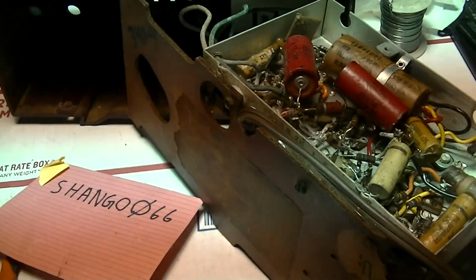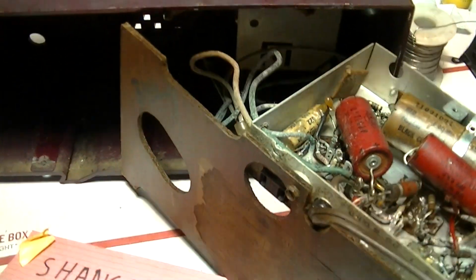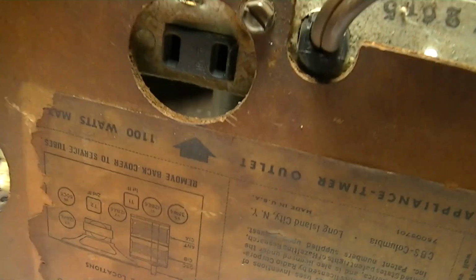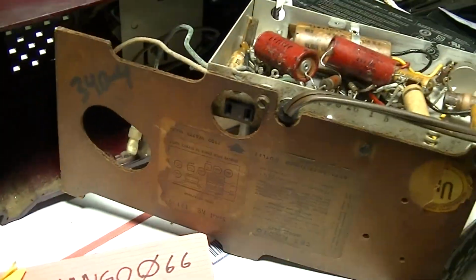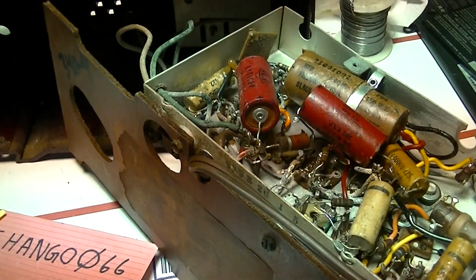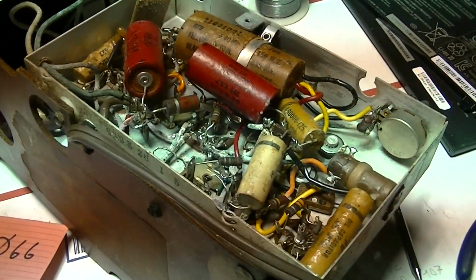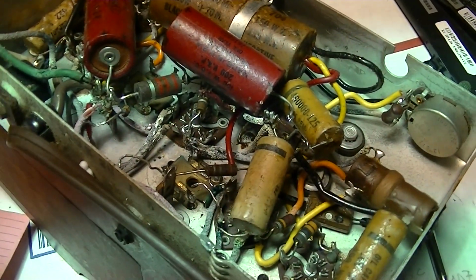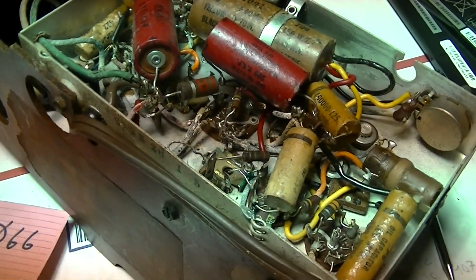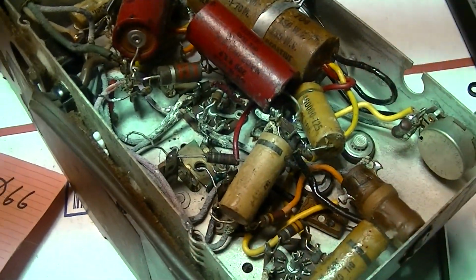Alright, straight to it. This is a 1956 tube CBS clock radio. It's a model 5440, just a typical All-American 5. This is video part 2. Watch video part 1 for the diagnosis. Bad silver mica disease or something in the IF transformers. We could actually see the IF transformers arcing inside through the plastic bottom.